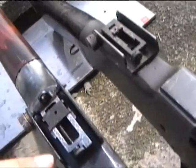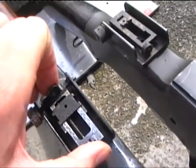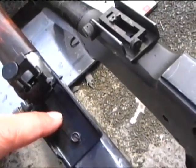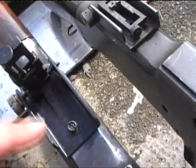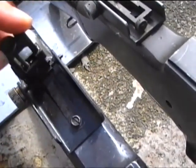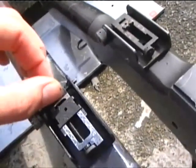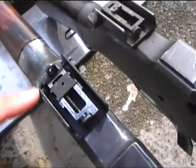You can do exactly the same on this one — it's just a slightly different design. I think they're Lyman sights. What I've done underneath is I've managed to find some spring steel, and I've mounted the spring steel down with a screw here so that it's pushing up on the bottom of that. It's not quite as precise as the original one, but it does the job. When it clips down, it holds quite securely.